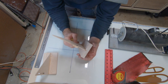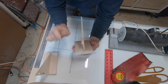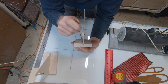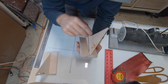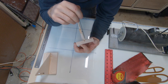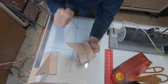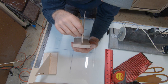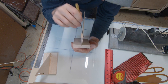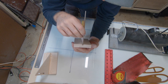And they're made out of 3/4 inch maple right here. I ran a table saw with an 1/8 inch kerf right down the center of this 3/4 inch maple, and just make it about 1/4 inch deep. And what you want is, once you run the table saw through the top of this maple 1/4 inch deep, 1/8 inch ply will fit snugly in that notch.